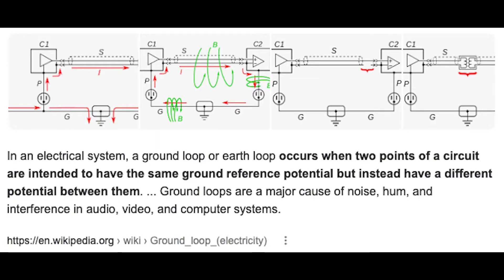I'm going to explain to you why you're getting that issue and show you how to fix it. Number one: why you're getting that issue. The reason is called a ground loop — I'm going to put a screenshot here from Wikipedia, you can pause it. Everything that you plug in, if you plug a bunch of things into one power strip or one power conditioner going through one outlet, that ground is bringing up the noise floor, which is projecting out of your speakers. That is the problem.